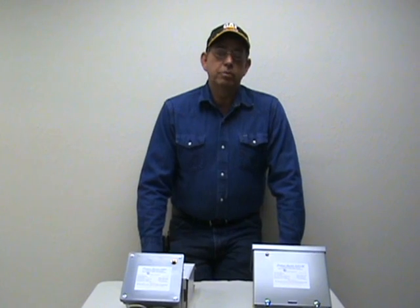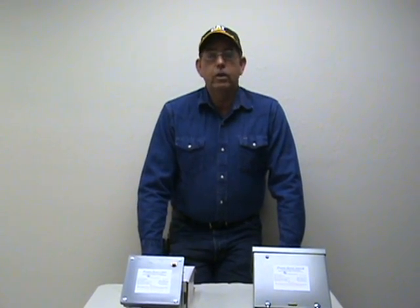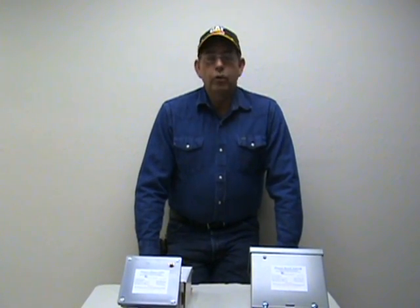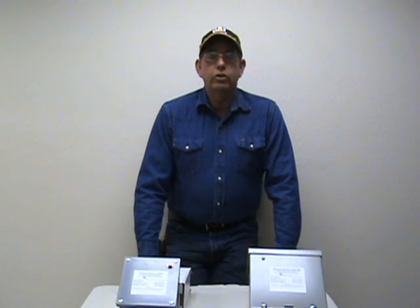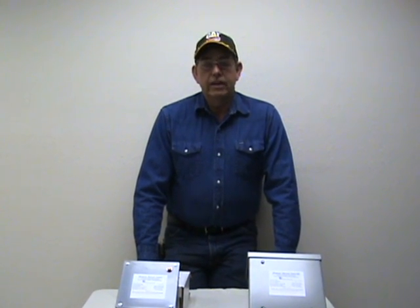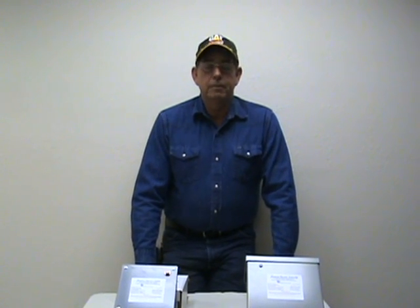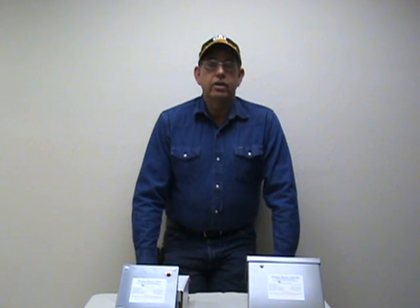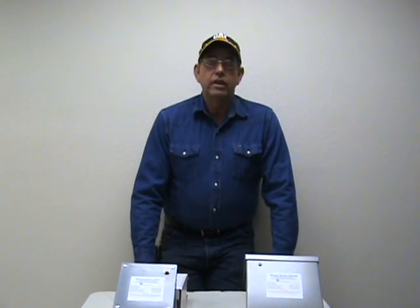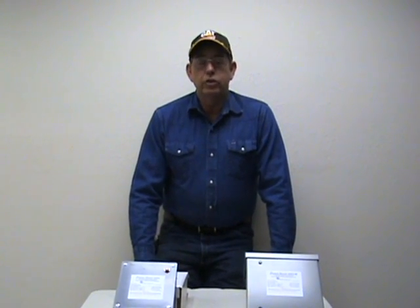What we do is we split our capacitor banks into two separate banks of capacitors. In doing so, we help the 240 volt side and your 120 volt side. Your 240 volt appliances such as your larger furnaces, your AC, those type of motors are fairly efficient already because they use two power legs from the system. So energy that is regenerated from the motors and pushed back can then be reused fairly efficiently. The 120 volt type appliances do not do that.